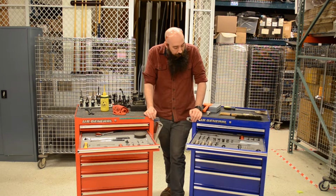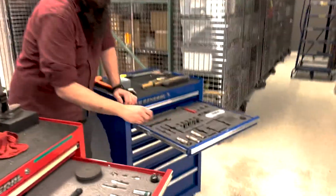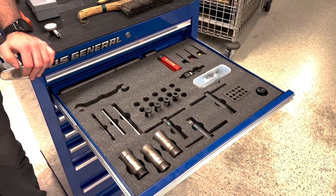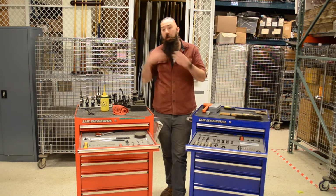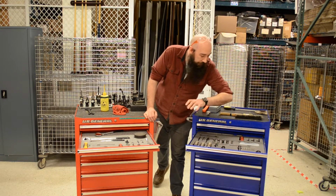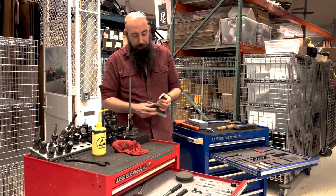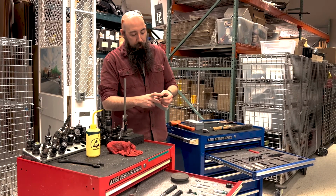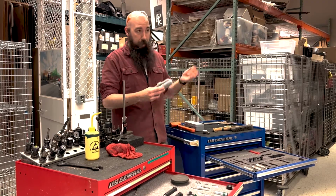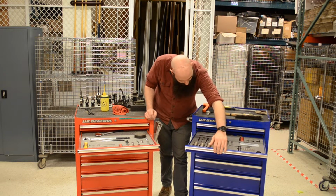So second drawers. These in the lathe and on the mill are going to be a little bit more specific things. So here we're going to hold the standard 5C collets that we use. So this is a 1/4, 3/8, and 1/2 inch, just because those hold additional tools that go in the machine all the time. Instead of going and finding them in the other tool case or the drawer, they're just here. So that's really nice. The different T handles, that kind of stuff. Another touch-off tool that I like, it's technically a mill tool, but we use it often for the lathe, is just an electronic center or edge finder, and we actually use this for setting off tools very, very quickly in the lathe. We used to have a whole other process that sucked. This guy is super duper helpful.